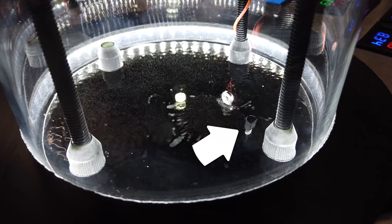The first is that everyone focuses on the cold plate temperature. I see -25°C quoted all over the place, but I feel the real magic number is probably only about -18°C. That is, it's the vapor that has to be about -18°C. The cold plate is only part of that. You notice we have a little Dallas 18B20 sensor poking up out for that reason. To get the vapor that cold, you'll need to have it hang around over the plate for a little while. So do your best to keep the airflow from coming into the chamber and try to keep the plates nice and level so it doesn't just flow away. High voltage isn't a must, but it does make the chamber more sensitive and makes things easier to see.